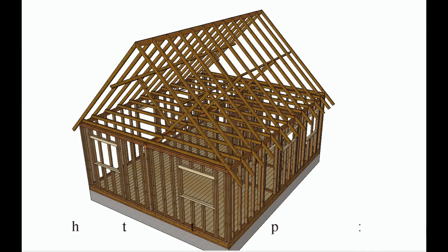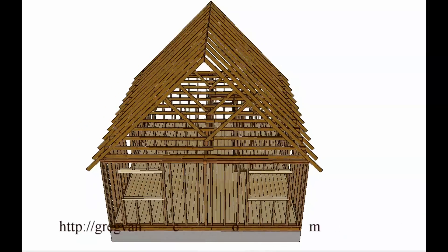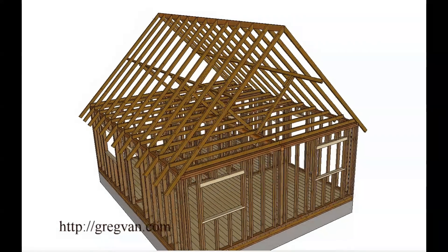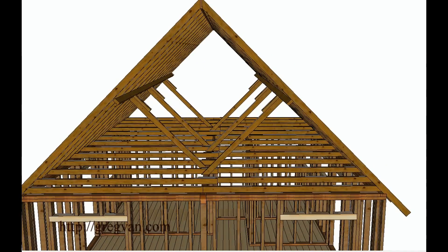In this video I'm going to show you an example of an older home that uses a roof purlin and some braces to redistribute the weight of the rafters more evenly. If you just had these rafters without the braces you would probably end up with a big sag. This was a real common method of framing and when I started out in the early days we did this every once in a while.